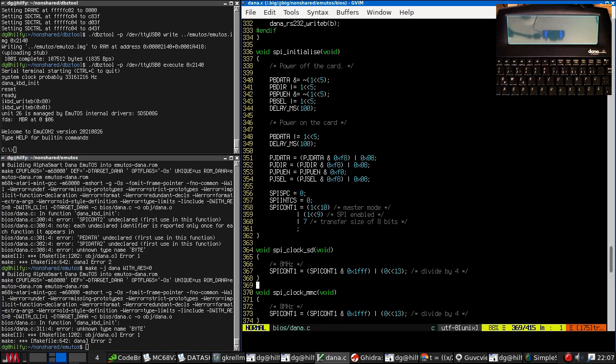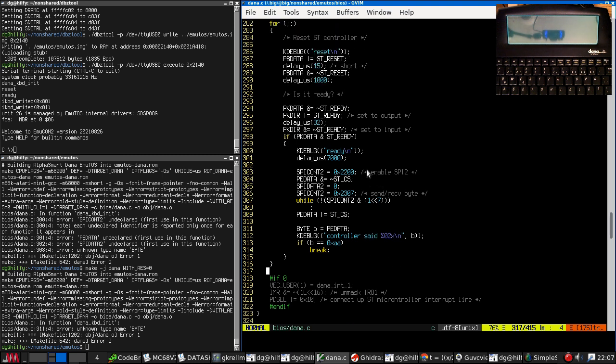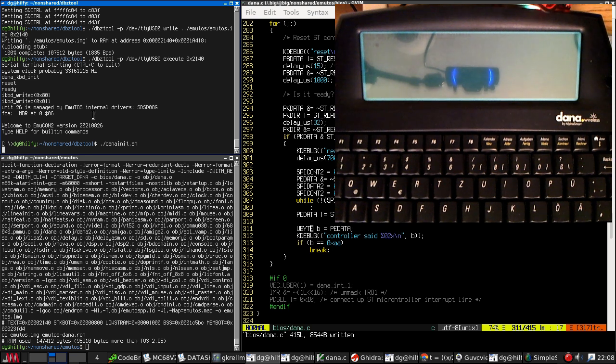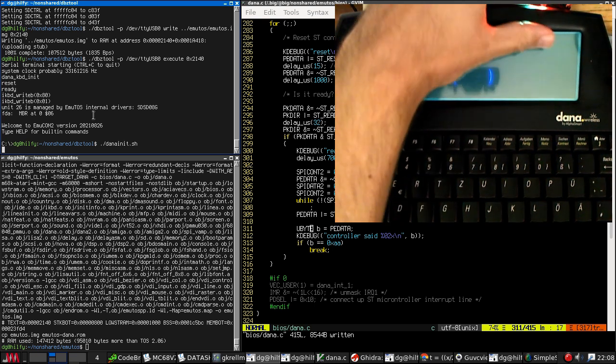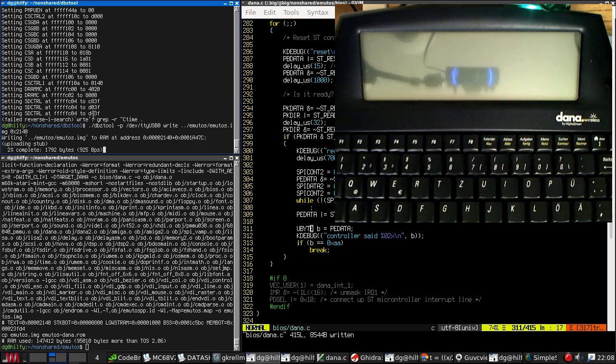I should point out that while I was setting up to do this particular session, I spent quite a lot of time trying to figure out why the initial gem image wouldn't run. And then I tried firing up PalmOS, and that wouldn't run either. It didn't do anything, and the backlight wouldn't come on, and so on. Till eventually I realized that I'd taken the thing apart in order to trace lines, and when I put it back together again, I had forgotten to plug the screen and keyboard in. So, yes, I think these videos are containing more incompetence than usual.